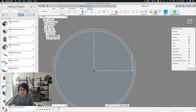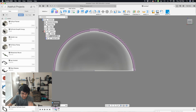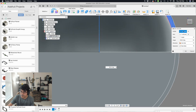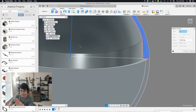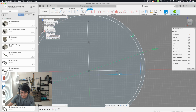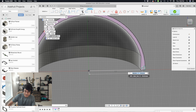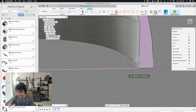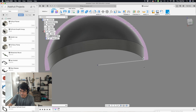If you were doing a cylinder, you wouldn't need to do this because your cylinder is already straight up. So let's go ahead and hit finish sketch, and then I need to append that little profile that we created. I'll double-click on our revolve inside the timeline, hold down Shift, and add that little sliver. You can see in the preview it's making a nice, straight cylinder. Hit OK. Now I can go back into the second sketch and paste that same math equation into the snap dimension. So now our snap is exactly flush with our straight geometry.